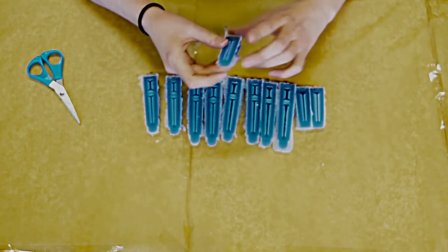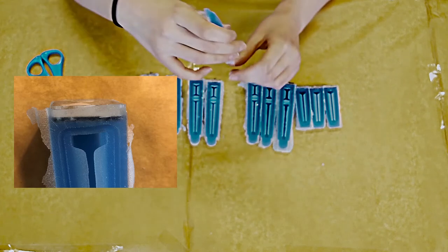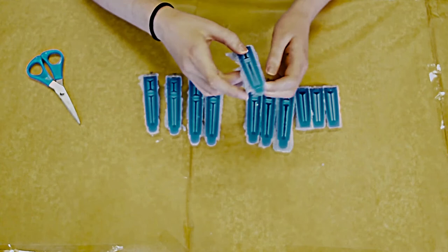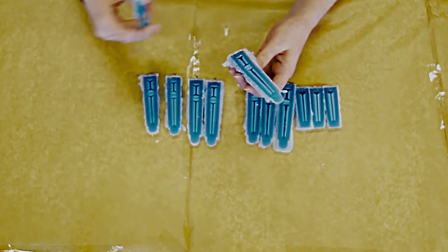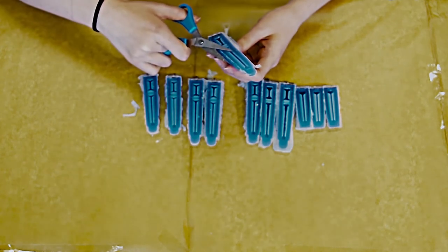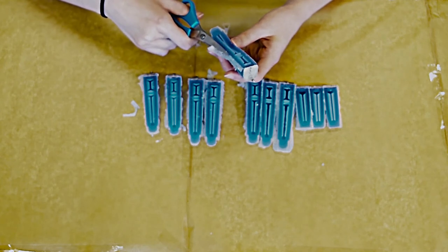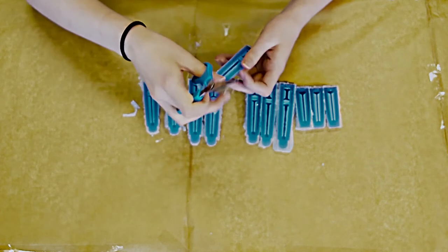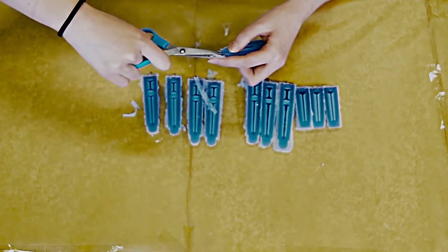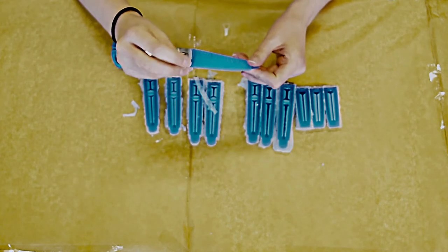If you're not sure about a bubble, ask a colleague. Also check for lopsided connector plates — if added at an angle, the whole finger will be mounted at an angle, which is also a sign of an unusable finger. Once satisfied there are no bubbles or lopsided plates, tidy up the edges of the finger by trimming off thin mould artefacts on the side. Try to cut in straight lines and not into the finger itself. Once you have a tidy, straight finger, you are ready for the next step.